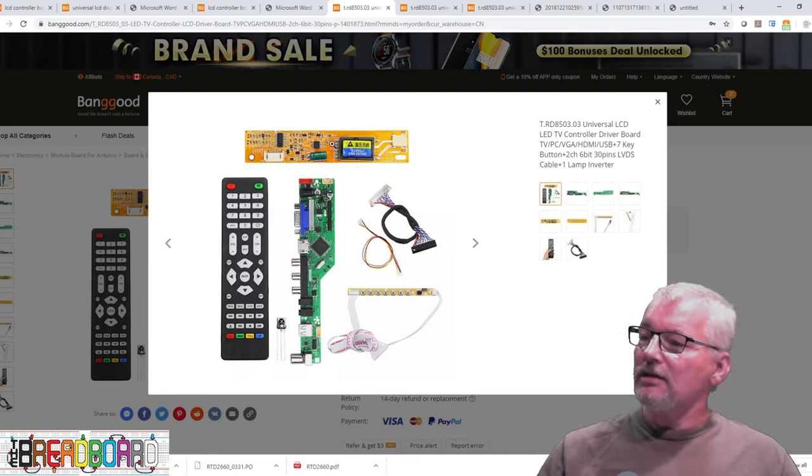From this menu you can also do a software upgrade — put a USB stick in, go down to software upgrade and tell it to do a USB update. We've already done it so we don't need to. If your screen resolution was wrong, that would fail as well. I happen to have a 1600x900 display here, so I'm going to leave it set up like this, grab that one and plug it in.